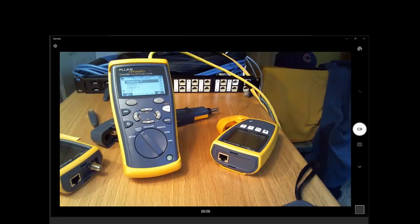So there is a feature in the switch ports to provision for PoE to be active on those ports at all time. And so there is a possibility, it depends on the IT manager, whoever's configuring that switch, that they can actually provision the PoE so it's actually transmitting PoE 100% of the time, and it's not necessarily looking for something. I think it's rare, but I think it's worth mentioning. But our equipment here has front-end protection, and if you plug it into something live, it will come up with a voltage warning and tell you, hey, disconnect this thing.